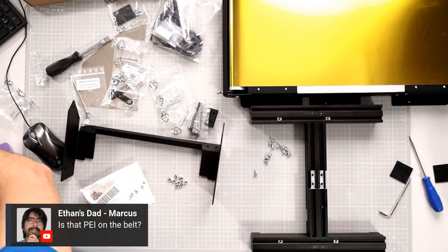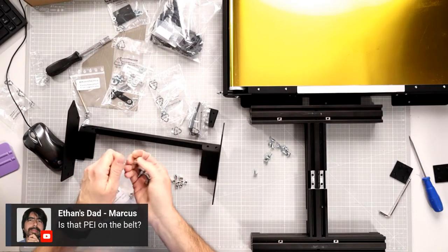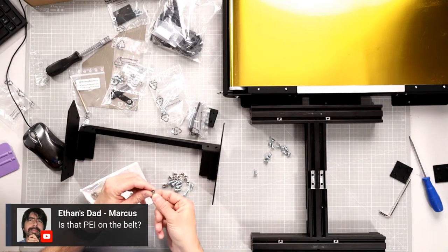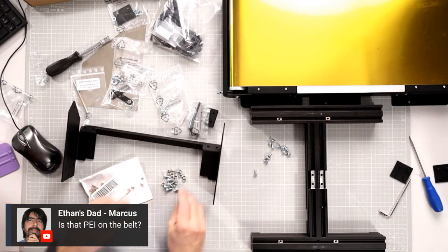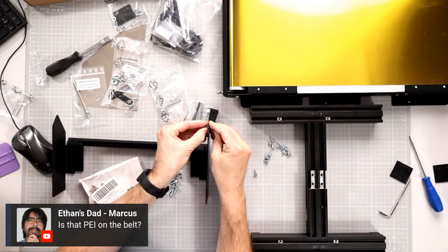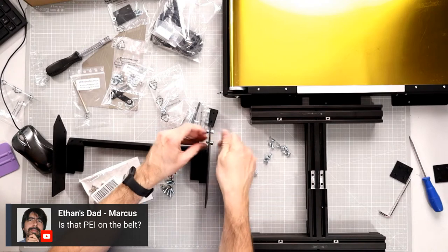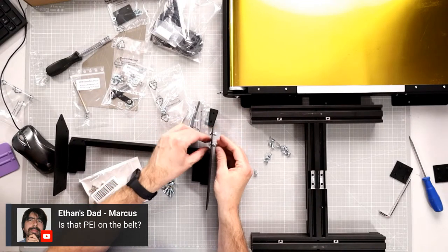The only issue that I have is that I don't have flat head screws here. So let's see where these are supposed to go and if they are hopefully not blocking anything, because these heads are so large. But this is hopefully not an issue. Okay, so I think we should have everything here. Partially screw the T-nuts on the screws passed through the side holes, both on the right side and on the left side. Here we go. Probably this is good. This is still working, although it's bigger T-nuts or bigger screws, but yeah, let's see.